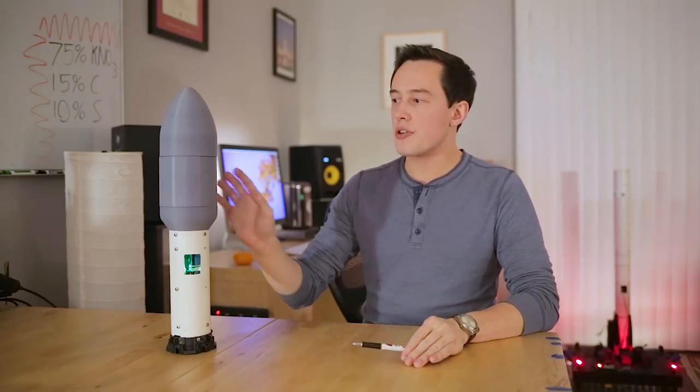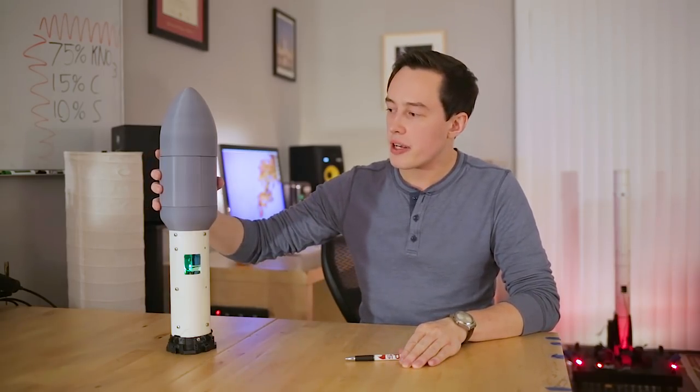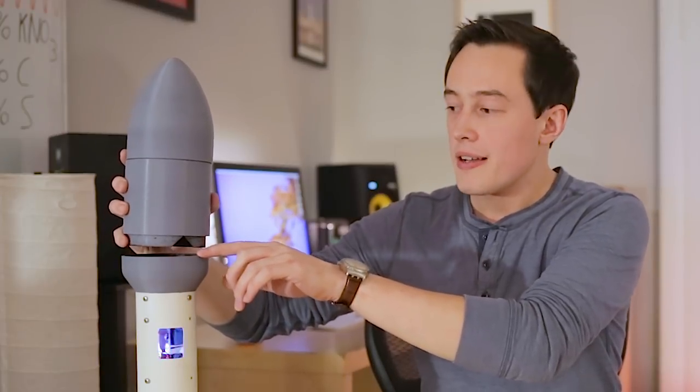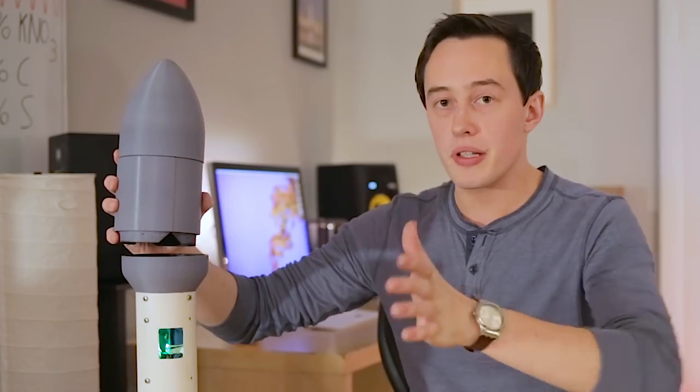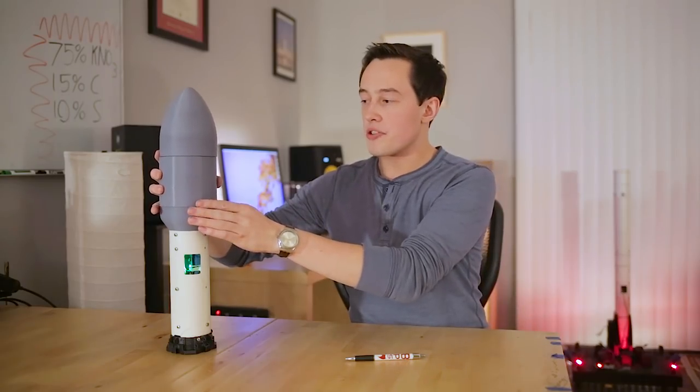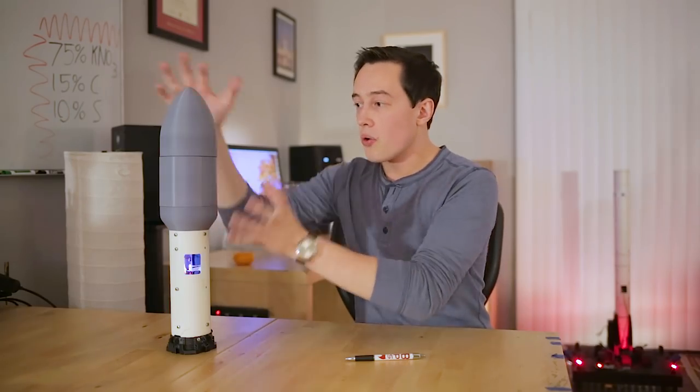If we go back and think about how this fairing design works, we can start to see why this is an issue. If one charge fires and pushes these two fairing halves past this point, this hole starts to open in the fairing. Now, this is basically a pressure release, and the way that this fairing deploys successfully is by putting a bunch of pressure really quickly inside this whole volume. We want to pressurize very rapidly.